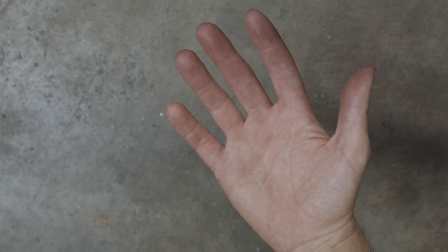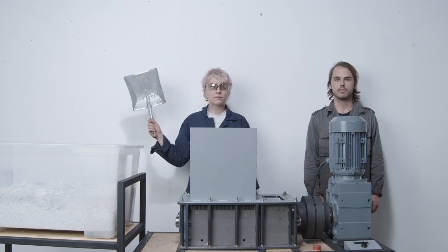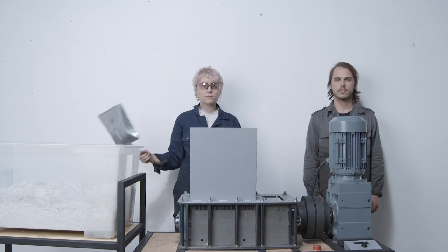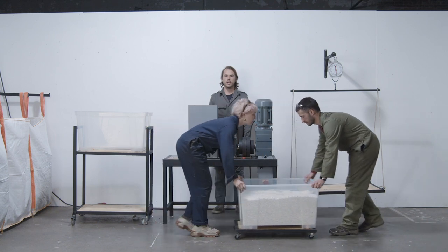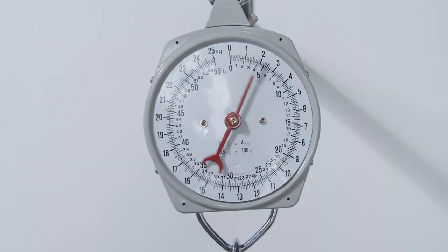Sometimes it's most efficient to shred the plastic once without a sieve, and then again with the sieve. In this case, it's nice to use the sorting trolley with a small shovel to transfer the plastic back into the hopper. When your container's full, swap it out for a new one. Before you put it into storage, weigh it and label it so that you and your customers know exactly what's inside.